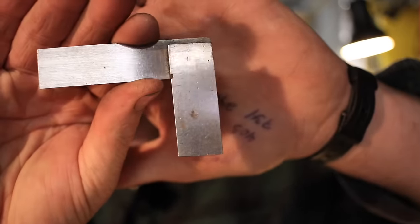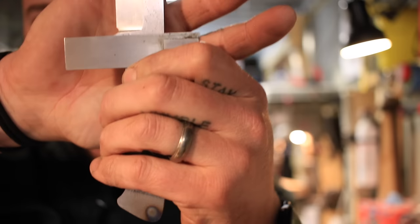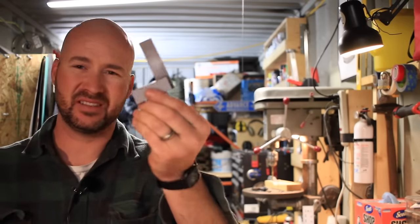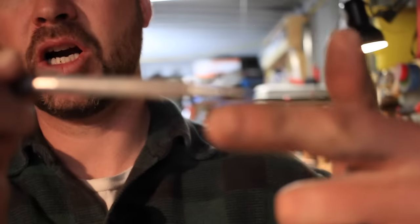If you have a chance — and these are getting a lot more common now — a small machinist square is a really handy option. It makes it super easy to do very precise markings on your knives in that you can easily hold the square and the knife in one hand and do your marking with the other. A small machinist square, if you can find one, is well worth purchasing — usually like five to ten bucks. Now you need to put your design onto the metal. For that you're going to want a metal scribe — it basically looks like a mechanical pencil but it's got a carbide tip. In conjunction with a large marker or jumbo Sharpie, what you can do is paint the entire piece of metal with the Sharpie first. That way you don't have to press your scribe in quite so hard to see the profile really well. You can also use a Prussian blue or a layout die — it just really makes the design pop and you're not going to accidentally cut through a line when you're cutting out your knives.